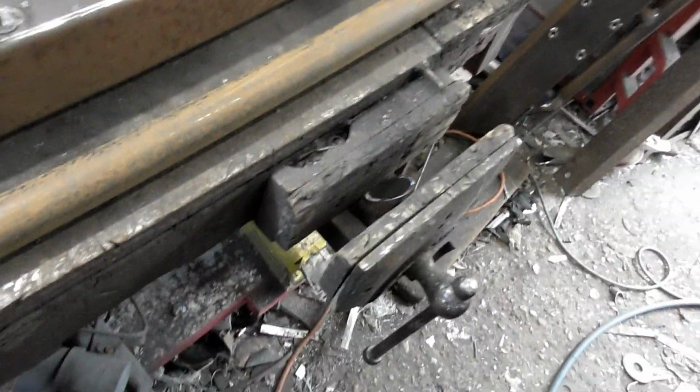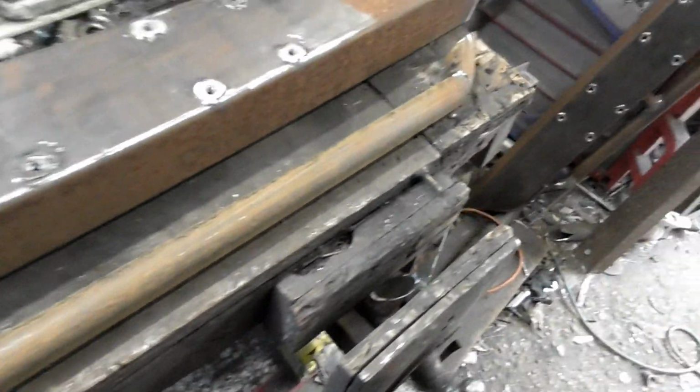Once I got that out of the way, I found that the sander gets rid of the rust quicker than the wire brush does. So then we'll sand this all back, get all the rust off, put some rust eater on it. I bought some of that, paint that all over, and then we'll rub that down, and then we'll put some Hammerite over all of it except for the back panel, because that's got to be welded on. And that's pretty much it. That'll be the 2 sliders.